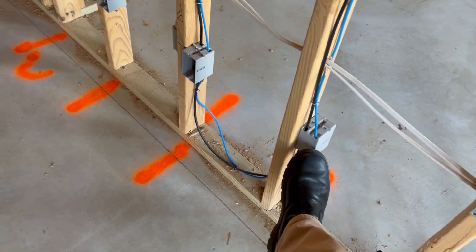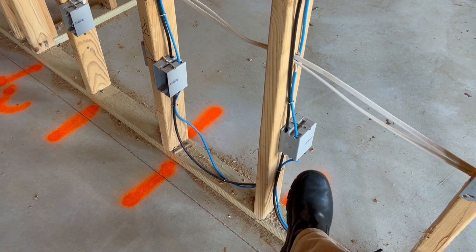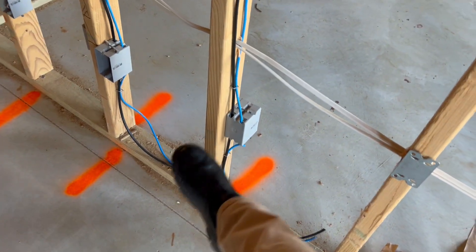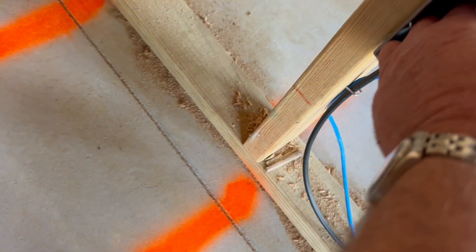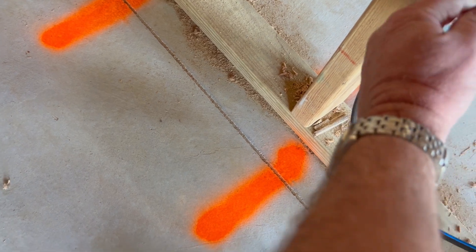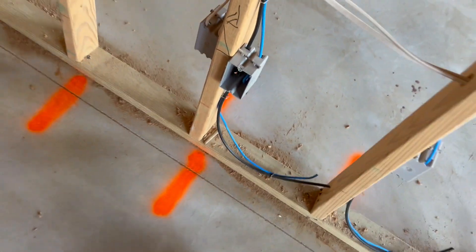You just have your new work boxes, and here's the trick: you run the cable a little bit long, put it in clips, so that way when they slam up the drywall you can very easily take your finger and pull up some extra slack.